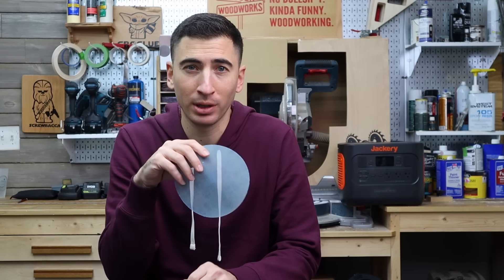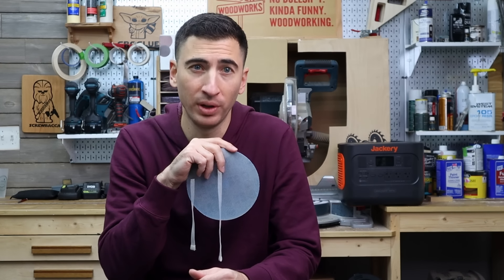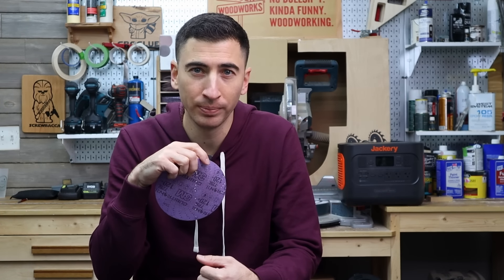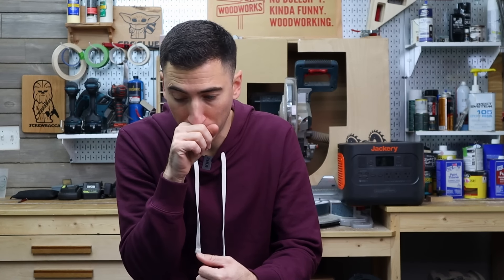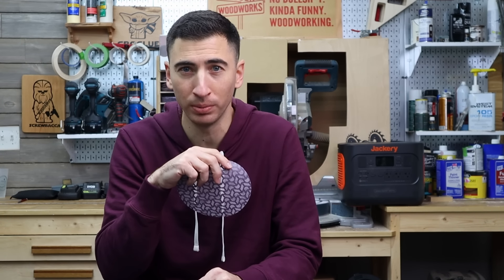So which one should you buy? If you're on a budget or work with resinous woods often like Home Depot 2x4s, I would recommend the 310W. It's the best bang for your buck on the market by a large margin, and if they rip or clog up early from the sap, it's not going to cost you much. Plus, if you're using some type of film finish, the rougher feel won't end up mattering. Now if your builds have a lot of sharp edges, or you won't be hooked up to a vacuum — woodturners, I'm looking at you — the 775L makes sense. Just be very careful of the deeper scratch patterns and be prepared to jump up a grit or two higher. If you do a lot of big flat builds — epoxy river table people — and you use a mix of hard and soft woods, I'm not sure there's a better disc on the market than the 710W. It's reasonably priced, removes a ton of material, and has a pretty damn good finish to boot. Yes, the edges will rip, but these tests have confirmed you're always compromising something.